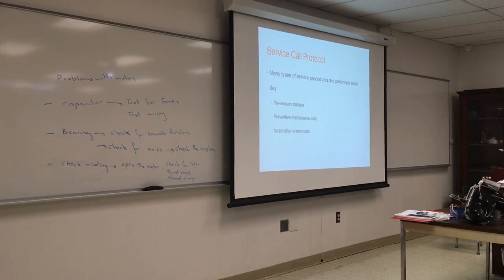Same thing with the oil burner. You try to turn on your oil burner in the winter, and it's not turning. Could be the motor is seized, could be the pump has collected a lot of dirt in it, which is really hard to turn. So starting from the beginning is always going to be an issue, yeah.